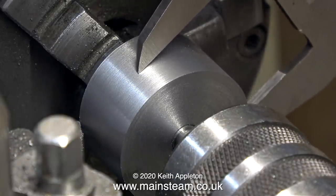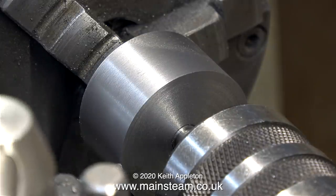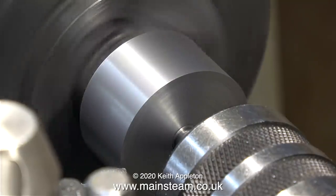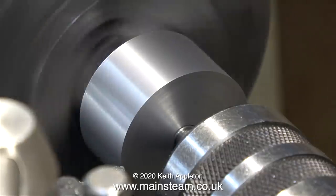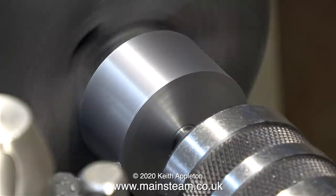Back to the job - have I removed too much? I set the caliper to exactly an inch and a half. I need to turn this piston about three thou under an inch and a half, which should match the cylinder. So for now I'm going to continue turning this piston blank to the required diameter, and that's it for this episode. Thanks for watching and I hope you found it useful.